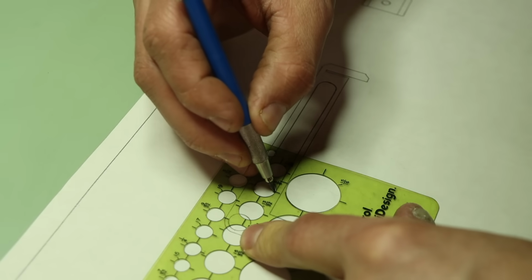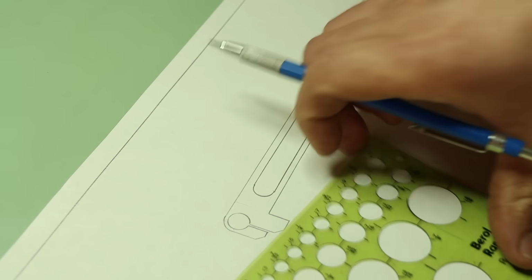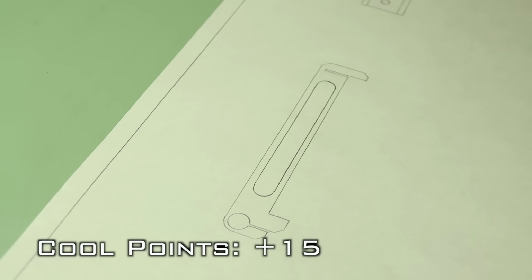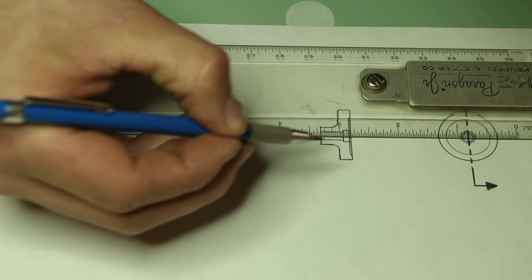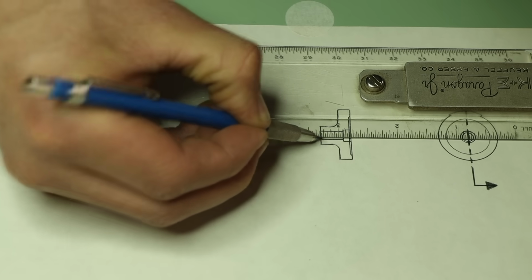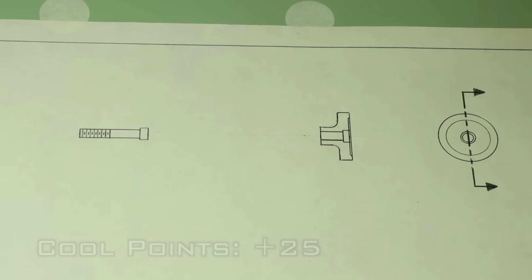Lastly, on this part, I'll include a sort of scalloped grip area to make it a little easier to handle. But if I'm being honest, it's just to make it look cooler. The screws will be a 2-piece design with a knurled knob press fit onto a custom threaded stud. This not only saves on material, but lets me make the knobs out of brass for added cool factor.